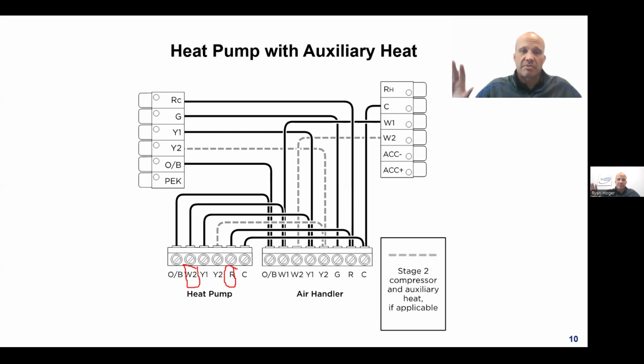So as I said before, the evaporator and condenser coil switch jobs. In the summertime, your evaporator coil sitting above your furnace has condensate on it, water draining off the coil and going into the pan. Well, when all of a sudden the outdoor coil is the evaporator coil, it'll also have water forming on it. And if I form water on the coil outside and it's below 32 degrees, that's obviously going to freeze, and then I'm not going to be able to run any airflow through there anymore.